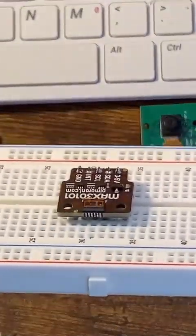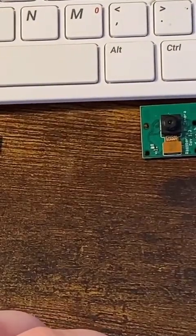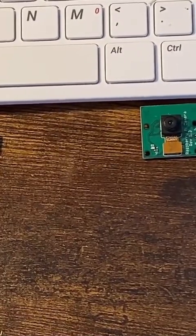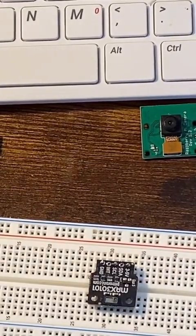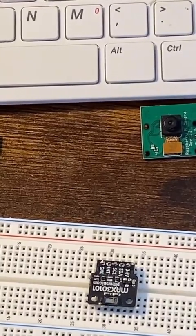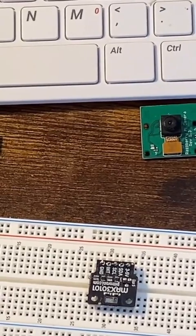Yep, that looks pretty decent to me. No, you don't need flux for this. Flux is really for when you're dealing, as he says, when you've got lots of tiny little pins and you need the solder to flow onto the contact pads rather than going all over the board.